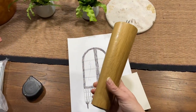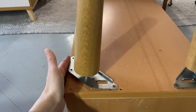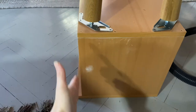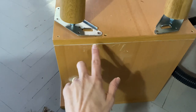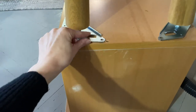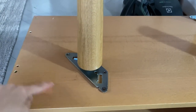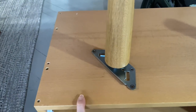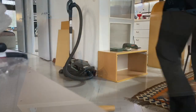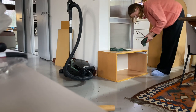I would like the legs to be a little less bulky, but this is what I have. I'm gonna lay this flush with the front because the drawer front will still be on, so I'm hoping this won't show. But here I don't want to bring it right to the edge, because from the side you can see it — so I'll put it maybe five or seven millimeters inwards. I'm gonna have to carve out grooves for the hardware because that will be easier than cutting the super hard metal. I eventually got it done, but let's just say I'm happy you can't see the bottom — it wasn't the neatest job.